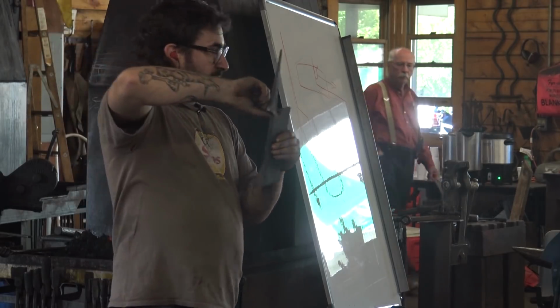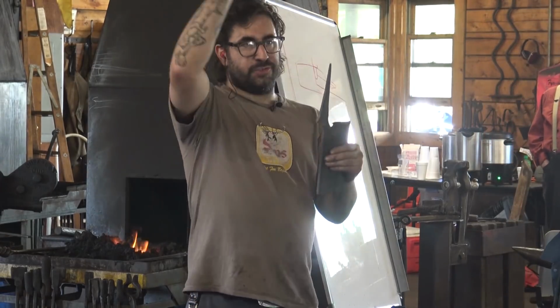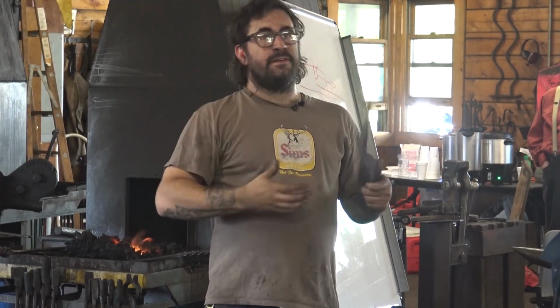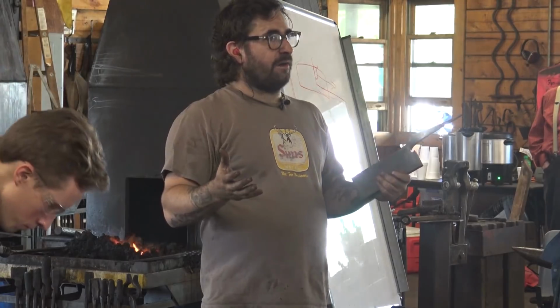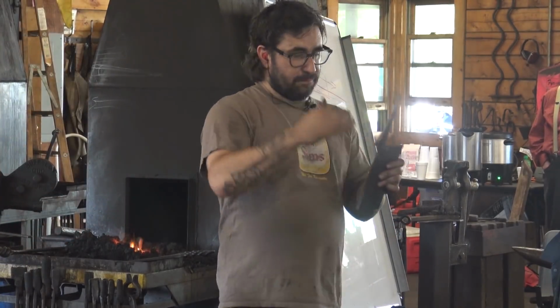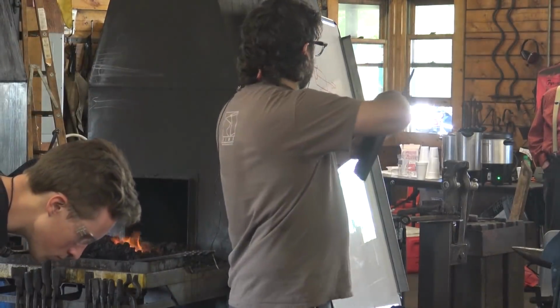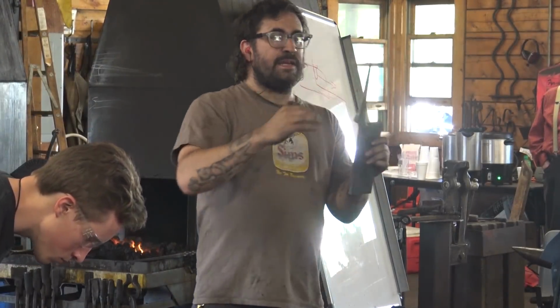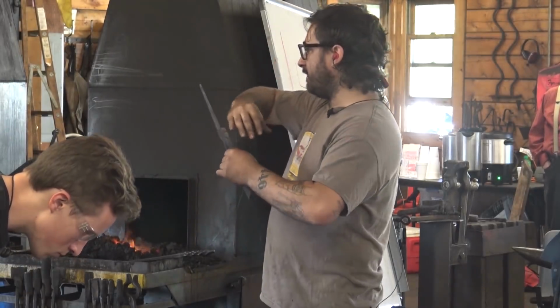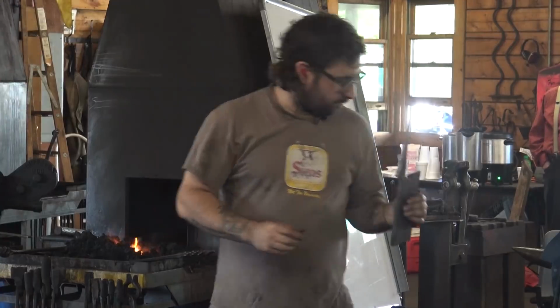Taper out on an inch and a half one, and then as the material gets smaller, the shorter the taper is going to be. And then I have, obviously, the freedom to trim them if need be, but I'm preparing myself to have three different size tapers by cutting and peeling away three different size chunks of material.